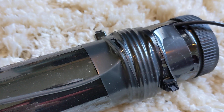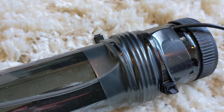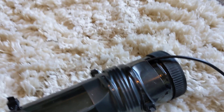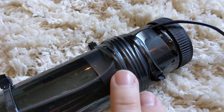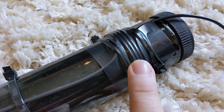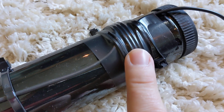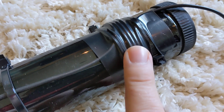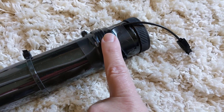What this does is, with a half-wave antenna, if you use it on multiples of the frequency, it pulls the resonant point down on the upper bands. On the lower frequency band — say, this is a half-wave normally for 20 metres — on 20 metres, that's actually quite a small inductance and it will effectively be ignored. But on 10 metres, it will have much more of an effect on the antenna and it will lower the frequency down. If it didn't do that, it would be resonating up on 29 MHz, so you need that.